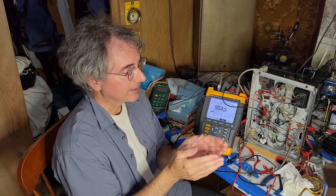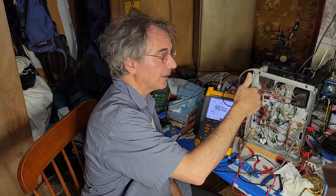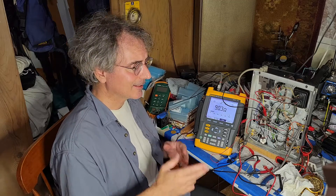The resistors on the regulator are set to produce 285V regulated output. The specs on the regulator say you need at least 12V above that on the input to stay in regulation. So if I've got 285V on the output, I need at least 297V on the input. Here's the other problem: if the bias current on the output pentodes is too low, I start producing crossover distortion before I reach clipping distortion. And crossover distortion sounds a lot worse than clipping distortion — we tend to not mind the early stages of clipping distortion in tube amps, but crossover distortion sounds bloody awful.